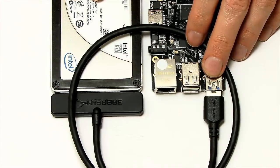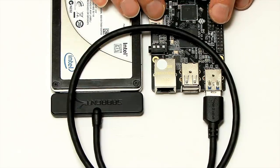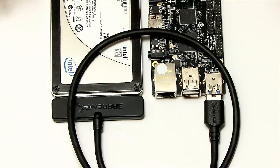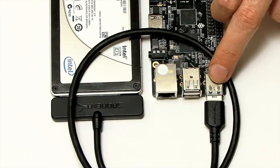You could use any USB drive to connect here — ideally USB 3 if you want it to be fast. This could be a two-and-a-half-inch hard drive. I'd personally be a bit nervous powering one of those directly from a single board computer, but I know some people do chance it and it works. If it was a three-and-a-half-inch drive, you'd certainly need an external power supply. Ideally I'd have an external power supply on a two-and-a-half-inch drive as well. Or you could store the data on your NAS on a USB 3 pen drive.